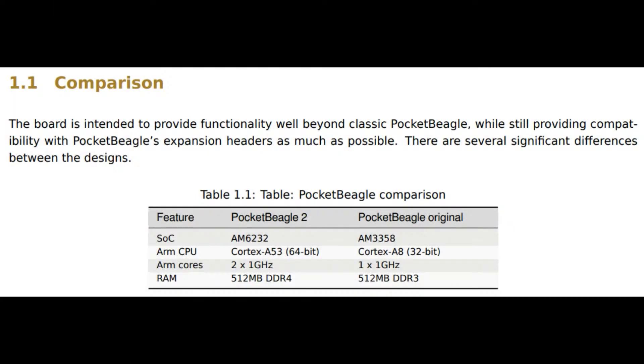The Pocket Beagle 2 is less expensive and comes with a better processor — a 64-bit Cortex-A53, so it can handle much more data much more quickly. It's a more recent revision of the ARM Cortex series. You've got a dual-core one gigahertz setup. There's also a Cortex-M4 — I think there's a dual Cortex-M4 inside running at around 100 megahertz or so. And there's a separately routed 512 megabytes of DDR4 RAM on board.